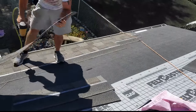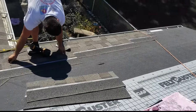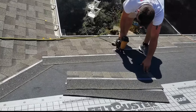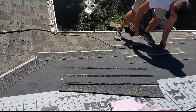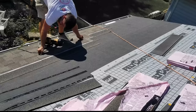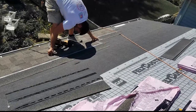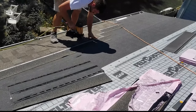So what I'll normally do is I'll feel this out like this. Right? You put that where it needs to go, because it creates, as you see, a big enough stair step right there. So you want to dry fit that so you don't waste your time cutting it. Right? Now I'm just paying attention to this outside shingle again. All right? This is left-handed, so it's slow.